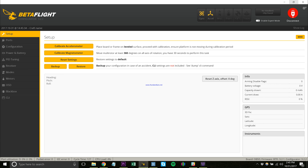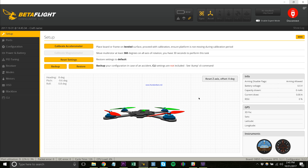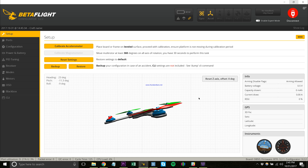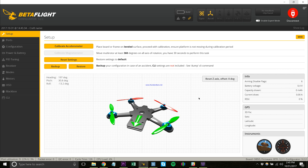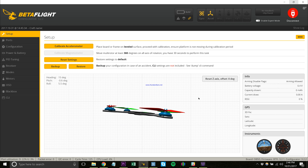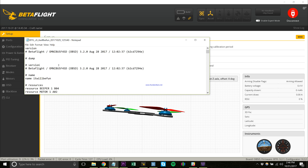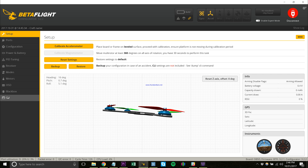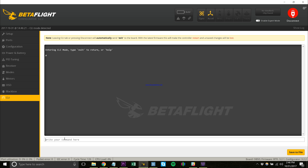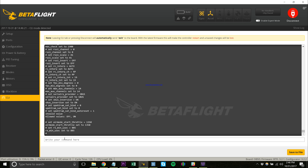Programming was successful, so we're going to go ahead and connect — and now it's open. Everything's moving. I'm leaning the quad forward and it's showing it leaning backwards because we have the flight controller and the 4-in-1 flipped 180 degrees on its yaw axis — turned 180 degrees to fit it inside the Fastback frame. You don't have to worry about that. I have a dump file linked below the video and on the Fastback sales page. You go into the CLI tab, paste the entire thing, and hit enter. It's programming your entire flight controller — this is a Taranis setup.